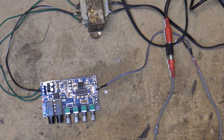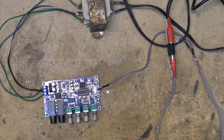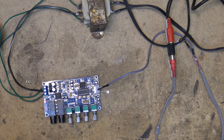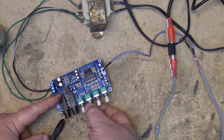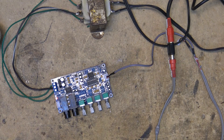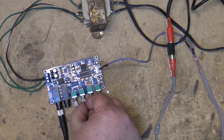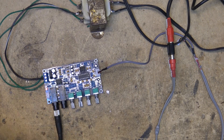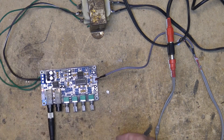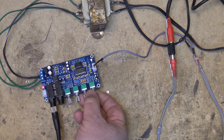I'm going to get a header to plug in so I can get some music in and out. I've got the header plugged in, so I should have sound to the amplifier. I'm going to put my microphone on here. You can hear this thing already — probably because it's cranked up. Everything is cranked up on here. Let's plug a microphone in and see whether we get any sound. There's my microphone. So now I can talk through here, and when I adjust these controls I should have my reverberation. That's the reverberation depth.